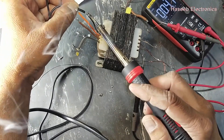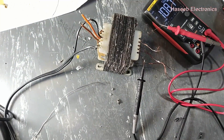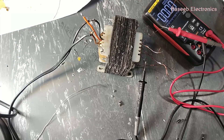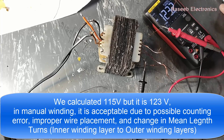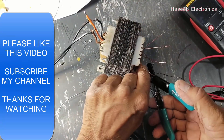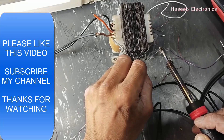This is neutral. For safety purpose I will connect between line and 245 — the last pin — and the multimeter is reading 108 volts. Now I will connect between the 220 line. Wonderful, we have 123 volts — that's good! Our calculation was 115 and I'll turn on my oscilloscope on this supply. Anytime we need voltage from these sets we can use them, otherwise I will make insulation. We will use just only the first and the last output. Always make proper insulation.